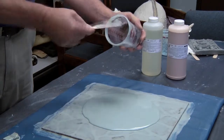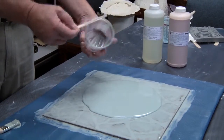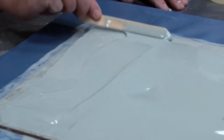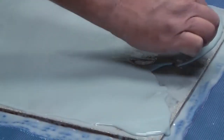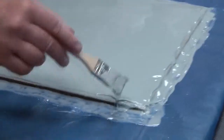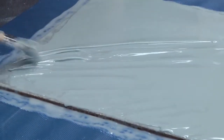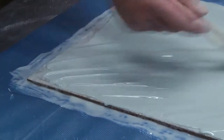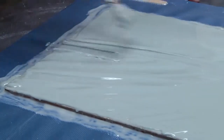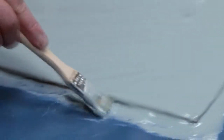As you see, the two materials are different colors, and as we mix them together it comes out to a nice low green color, which shows you that it's mixed properly. Only about sixty seconds is required to mix these two materials together. For the second coat, if you allow it to thicken a little bit, it can go on a little thicker. Again I go back in with a chip brush, moving the material around from side to side, edge to edge. Your edges will probably need a little bit more working when the material becomes thicker, as they flow off those edges quicker. We are reaching up into the mass and bringing it down to the edges and sides for a little better distribution.